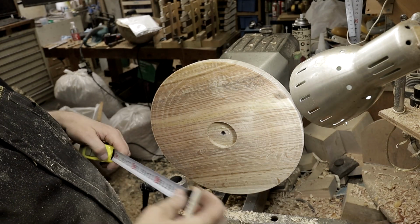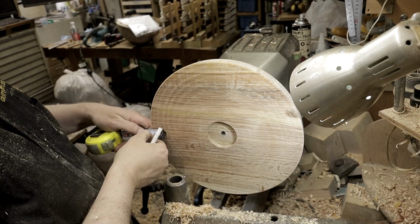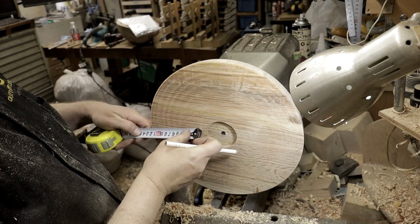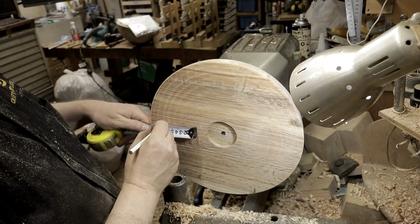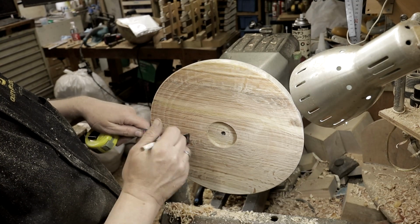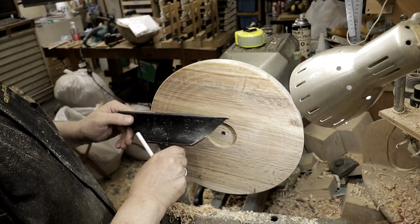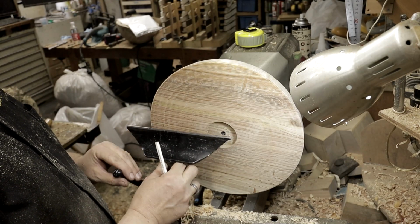Okay, so generally you go 10%. So this is just over 30, so you want to go 3 centimeters. So I'll start from the 10 and go to the 7. It's about there. And then the blade is about that wide. Oh, hang on, I need this. Still need this one here. Do the magic pencil trick.